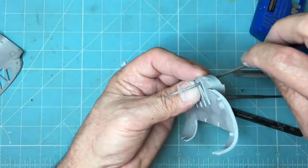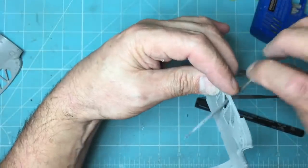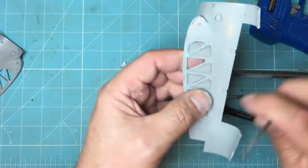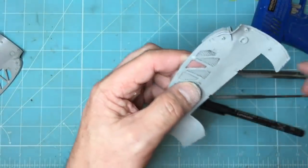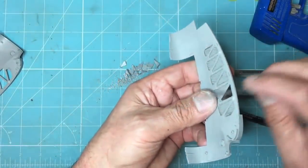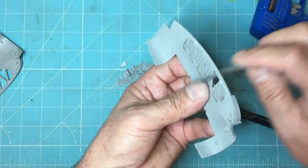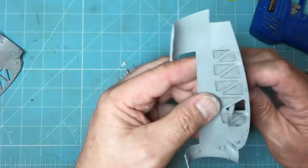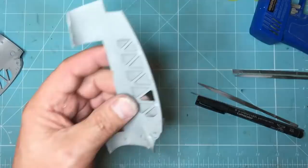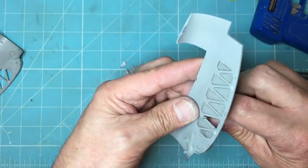So straight like that in when you're in a radius. Let's do it this way on. Now this way on, sorry. And then as soon as I come down here, you can see I come on an angle, straight angle. And that way you won't make a gouge in. If you start to do this on the edge, you will actually go in and you'll make a radius in your flat area. So if you just come along there, this one's a little bit finer. Go into the corner, get the knife again. Just scrape some of that plastic out of there.